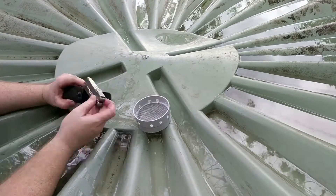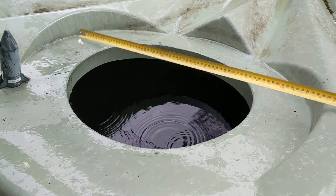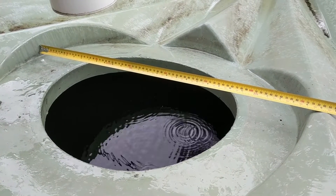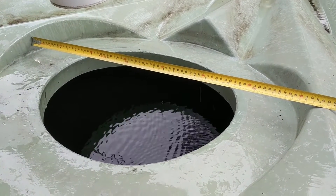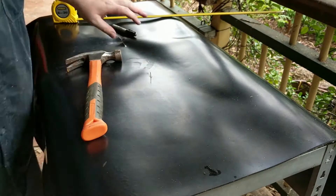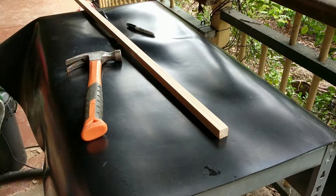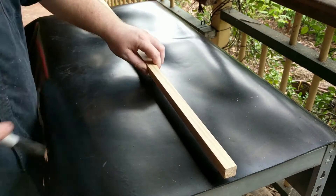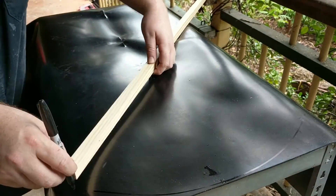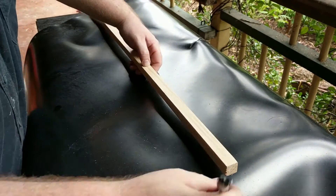I went and turned my sprinklers on to alleviate that water level and moved back to the inlet problem. For this I measured the available working area around the inlet. I had a lot of rubber matting lying around, which I felt would be perfect — cut to size to cover the inlet, then cut a couple of holes in the rubber to allow the downpipes from the inlets to pass through the rubber straight to the inlet itself. This would create a good barrier for leaf matter and other materials from collecting on the screens themselves.